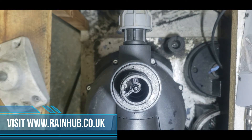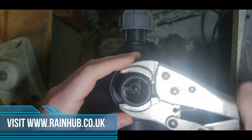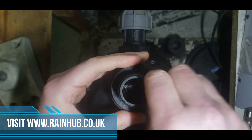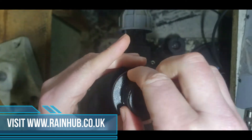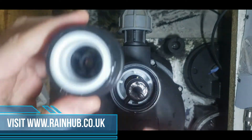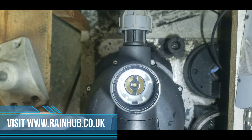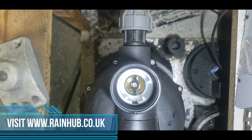If that is not getting your pump to turn on, what you'll need to do is replace the non-return valve. To do that, the first thing you'll need to do is loosen this front part here and take it out. You need to check there is no debris or anything — this white area is completely clear, and in the same point the white area here is completely clear. If there's any debris, that may well be stopping the non-return valve doing what it should be.